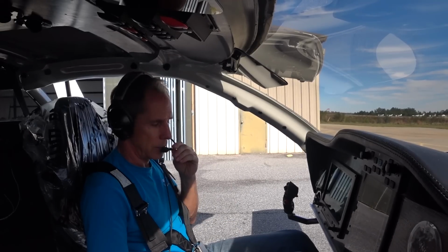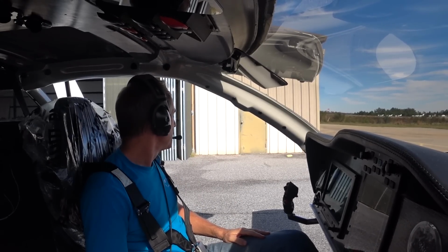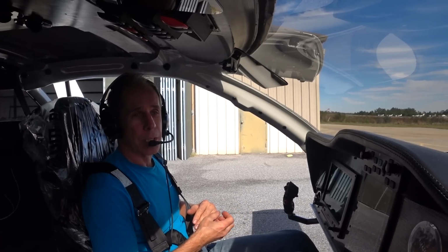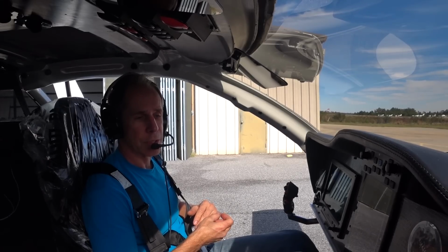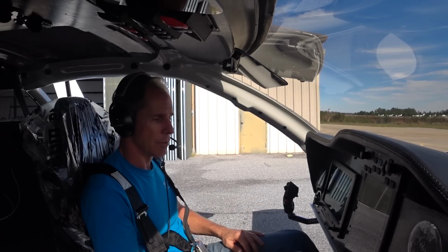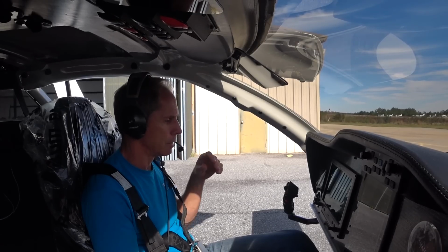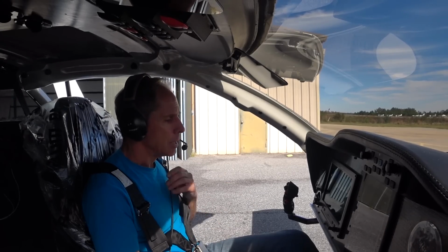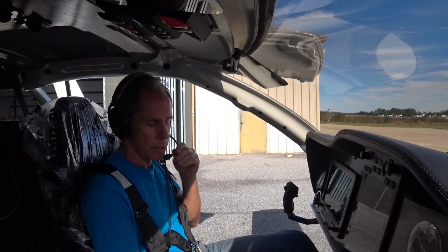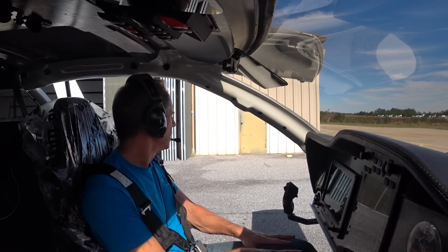All right, it's a little windy and breezy today, so I'm going to test a couple of things. I've just hooked up the glow plugs on the engine. I was having trouble starting it on the colder mornings, but now that those are connected and the ECU is driving them, it started up right away, although it's not that cold right now because it's after lunch already. It is working, though, and I'll probably have to dial in the parameters a little more just to make sure it's not overworking it.